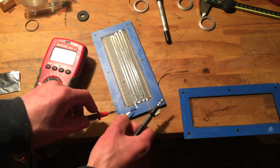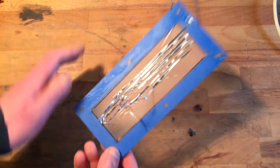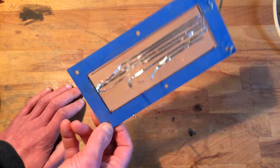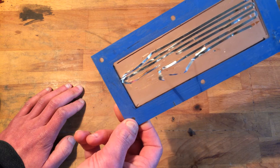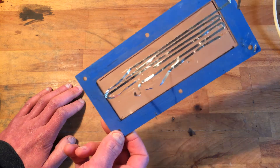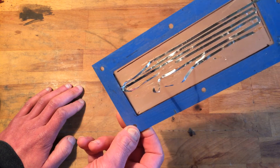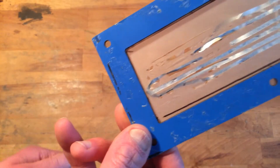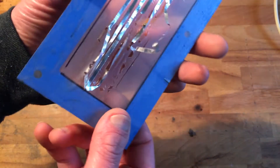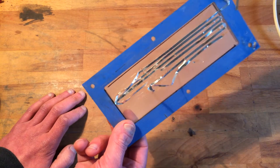No, you cannot eat these wires. 1.1 ohm - my amplifier will love it. I connected it to my amp and I wanted to test it, but I forgot that the volume was set quite high. There was no capacitor in the line, and also when the USB dock powers up I think it puts out some DC, because it was fireworks. This is how my panel looked - it really toasted through the mylar, even the diaphragm broke. After so much effort it blew up in a second.